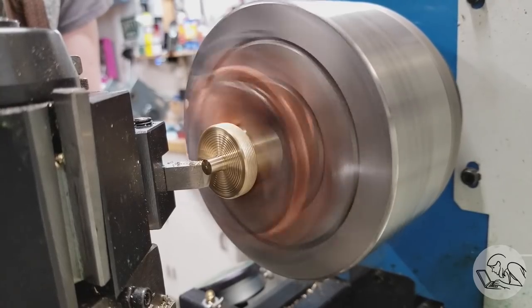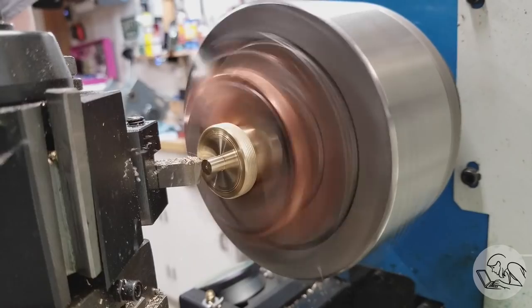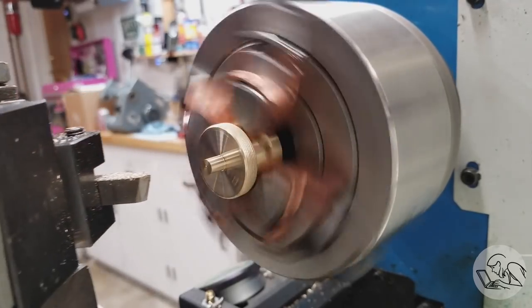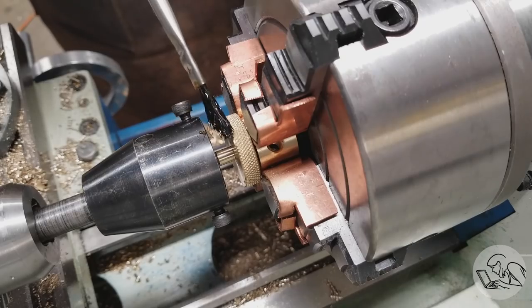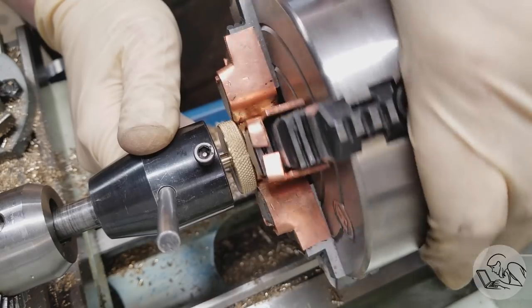And on the final pass, I turn in and lock the carriage and wind out, and you can see all the striations on the face there as I did each pass up to the same mark on the indicator, so a facing pass removes them all. And I'll go ahead and put a nice little chamfer on the end of that just to help the thread die get started. And then I'll come back in with my tailstock die holder and cut the quarter 20 thread on there.